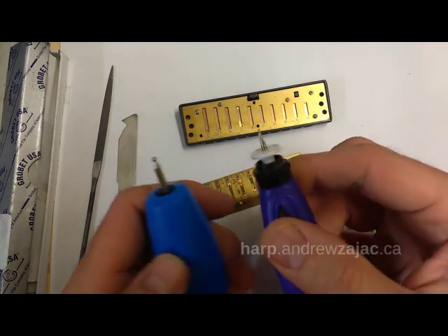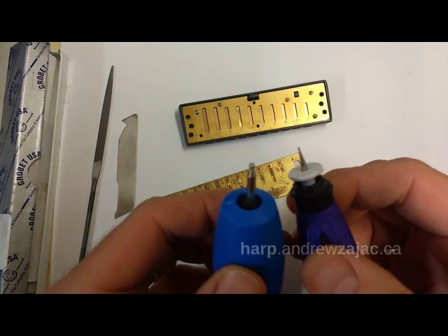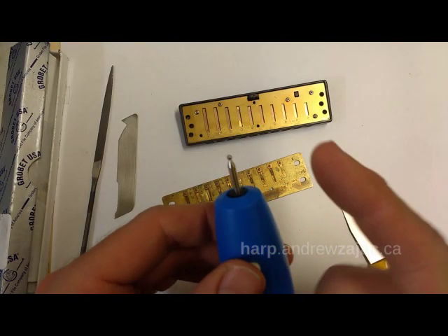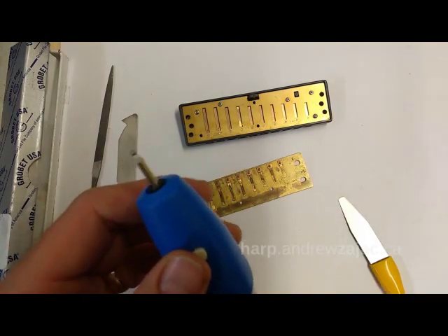The trick is to get a rotary tool with a very big tip. See, this is a commonly available one — you can see how small that tip is. This one has a very big ball. Start it and stop it and keep your eye on the tip. If the tip wobbles as it spins, forget it. You're never going to get a good result.